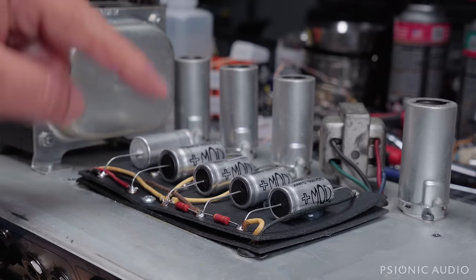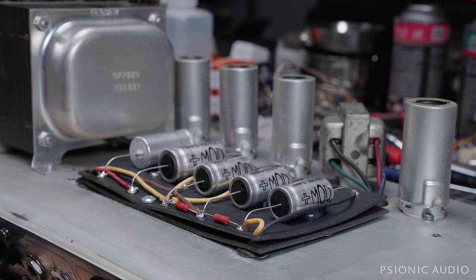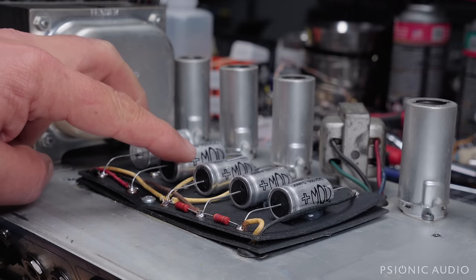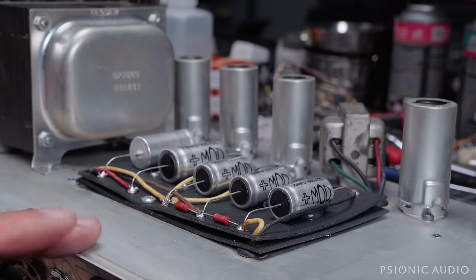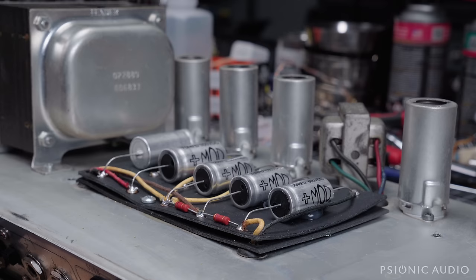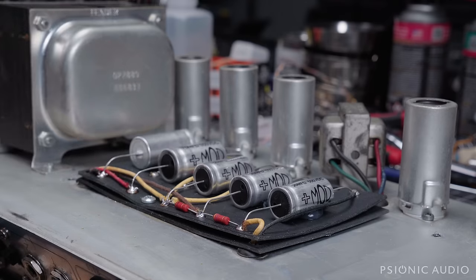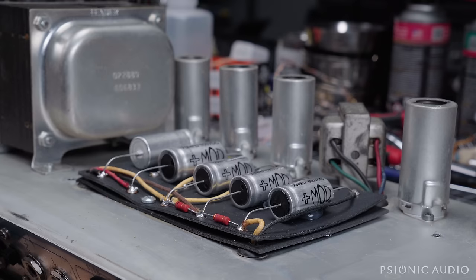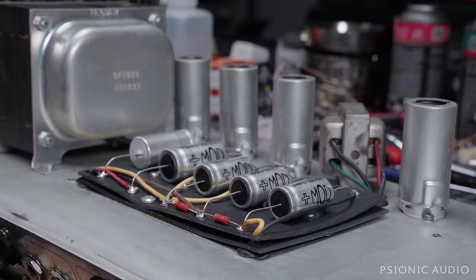Left to their own devices, they won't have exactly half the available B-plus on them. Let's say the B-plus unloaded is 550 volts — you're not going to have 275 and 275 volts on each one if you just have the caps in series. So we put these resistors across each capacitor, and the two 220K resistors force the voltage to divide equally — that's a one-to-one voltage divider. By doing that, we have exactly 275 volts per capacitor, so one capacitor is not bearing all the load, and each one will last longer and run cooler.